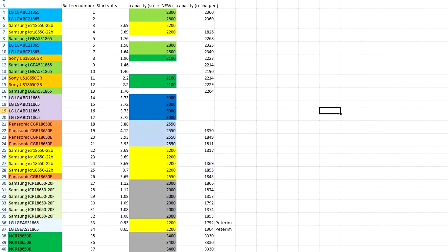Out of 9 laptop batteries, I got 41 usable 18650 lithium-ion batteries. All batteries were numbered, the capacity was found on the internet, and the remaining capacity was noted — because they are not new batteries. But still, they're excellent for LED flashlights, DIY Bluetooth speakers, and other projects. A single 18650 cell costs around $4, which means we just saved around $160. Very nice.